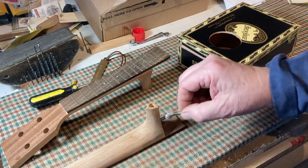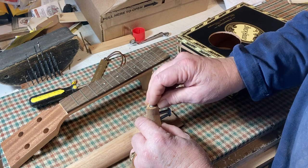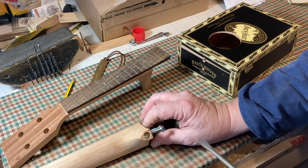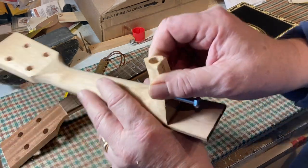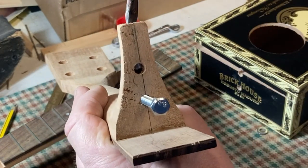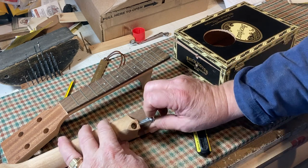Now, the other one, we're going to drop in now. So all we do is take our barrel bolt. I'm going to put that in there so it doesn't drop all the way through. I can drop that in — it doesn't need forcing. You want to make sure that it's a nice, clear fit, otherwise you're going to split the wood. There's not much round here to give it some strength. I'm just going to pull the bolt out, push it in a wee bit. And then you can see the bolt is beginning to come through. I can press that down a wee bit, and then I can thread that on. If it doesn't properly align, you can take a flat screwdriver and get that to align so your bolt will go in.